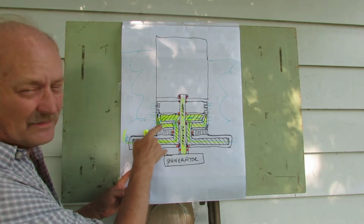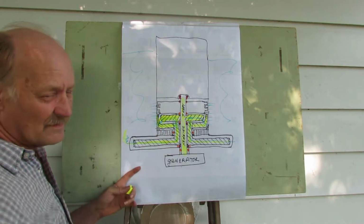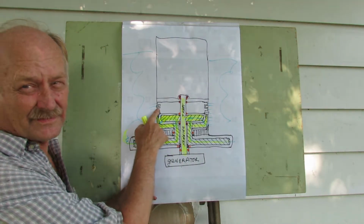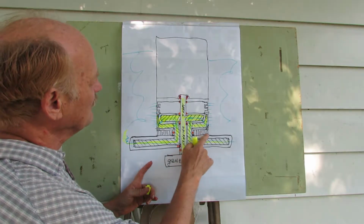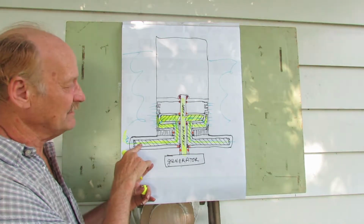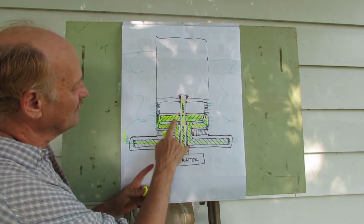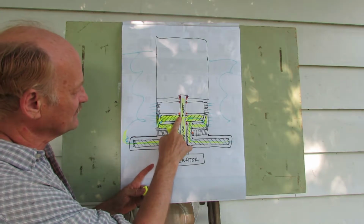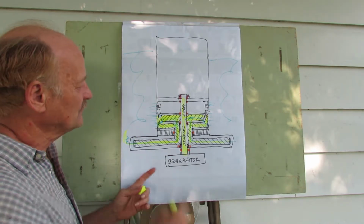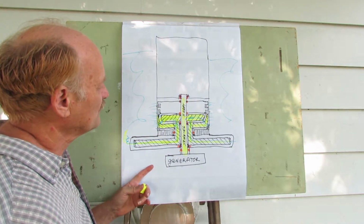And by creating enough water in there, we can multiply the pressure and force that water out, just like a hydraulic jack does. A very similar process. This is piston displacement pumps. This is a secondary type of option. And this is an action of high pressure water turns the turbine down here, which turns the valving up here. The pressure of that water that's now into the machine turns the turbine up here, where we take the pressure out of it, and then we force the water back through these valves into the ocean. These are just small little holes, and they'll have a little one-way valve on it so that the pressure doesn't come back the wrong way.